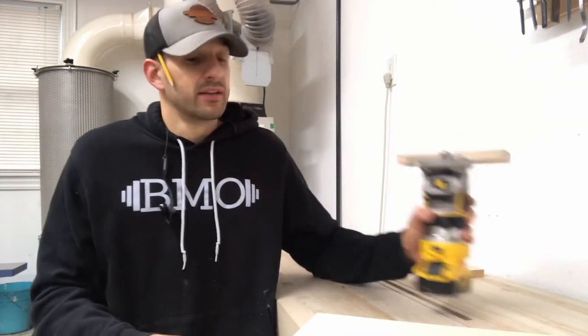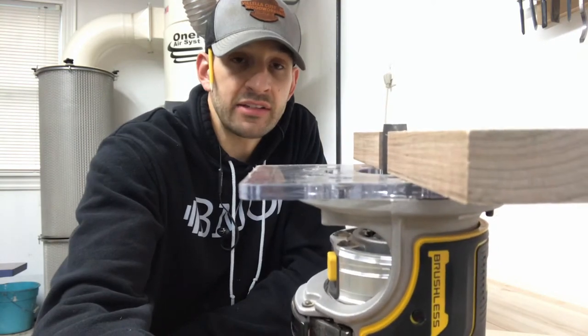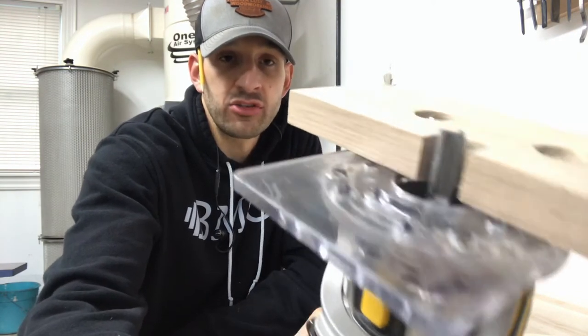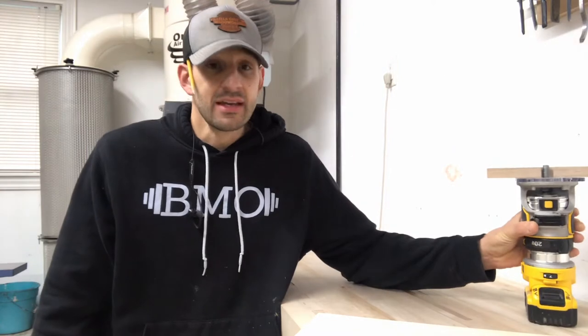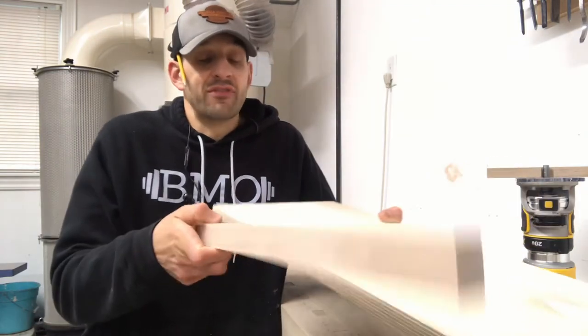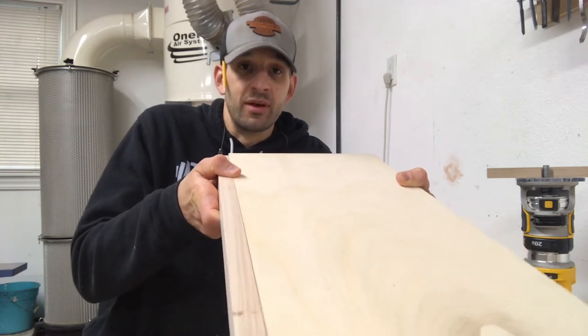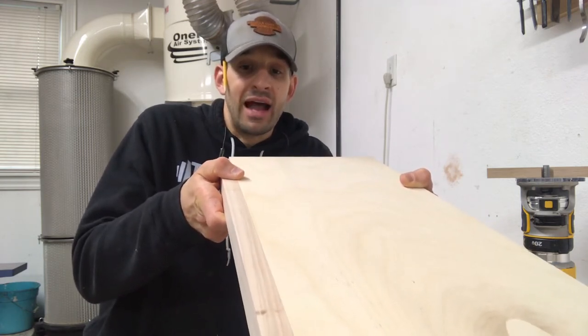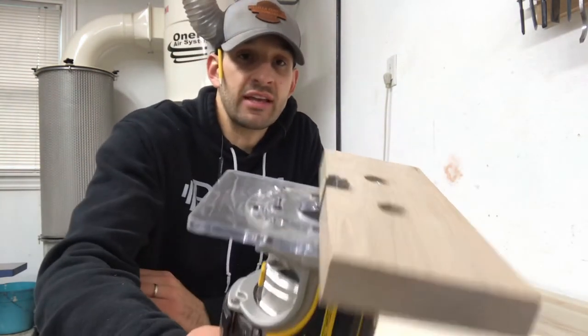So the first part here is prepping this piece of plywood, and this has honestly been such a difference maker for me. It's this 1/4 inch plywood trim bit from Collins Tool Company, and I'll link it in the description. I got this tip from Spencer Lewis from Insider Carpentry. What I was having trouble with when I would attach this piece of edging, even using clamps, nails, whatever it might be, I never could get a really consistent seam between the plywood and the piece of trim. And ever since I started using this trim bit, it honestly has made such a difference.